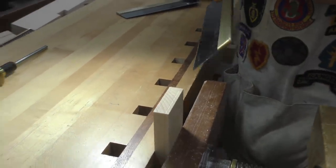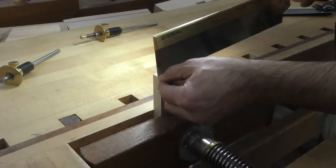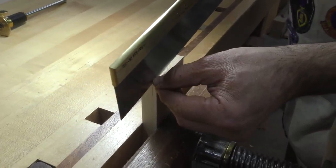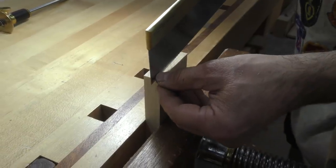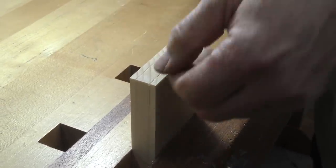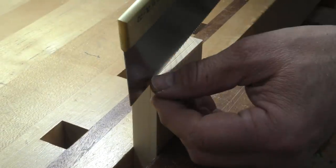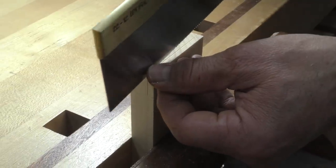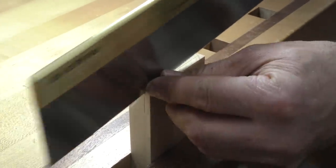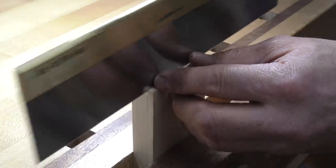Now that is a long cut to make, and to get it accurate there are a couple of things you can do. You can start by working on the far side — I am always pressing the saw laterally against my fingertip, or in this case my thumb, so that I can control where that saw is going to start cutting. I find it easier if you get it started right like that and then saw on an angle until you have come all the way along — you have established your saw kerf along that line. That way you are not trying to watch this line and the one down the face at the same time. Now this is going to cause me to drop down, so I am not sawing at too great of an angle. And if I need to make adjustments, I can pivot and just alter the saw so that it is following the line, staying on the waste side.